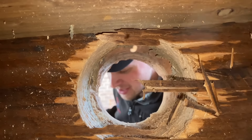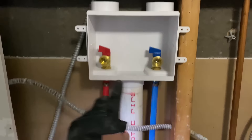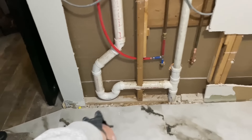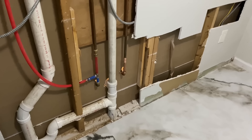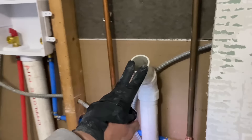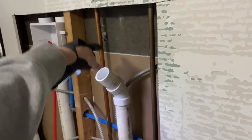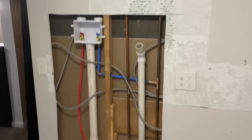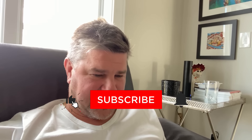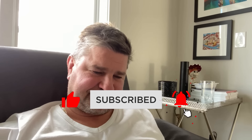Alright, so there's the wash machine box — two inch drain, the two 45s, the glue trap, the new two inch TY, the two inch by inch-and-a-half TY with a two by inch-and-a-half bushing on top coming up for our mechanical vent. Once he's done sheetrocking, the 45 will go on there with the air admittance valve on top. We had 18 minutes of video and I realized the storage on my iPhone 11 ran out and stopped recording — but it's all good.